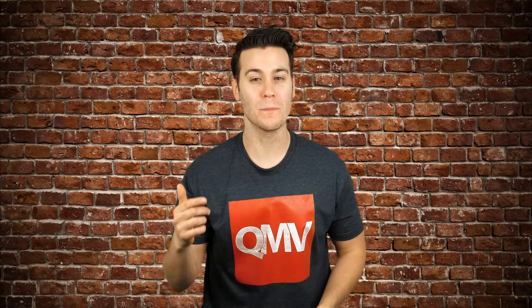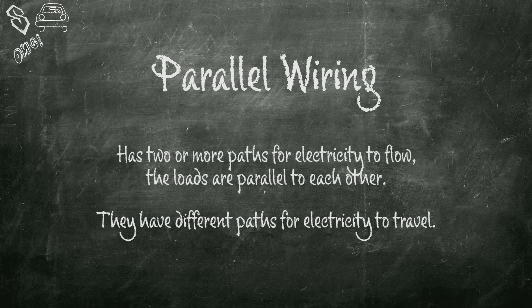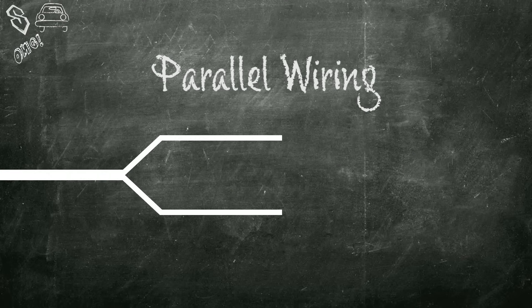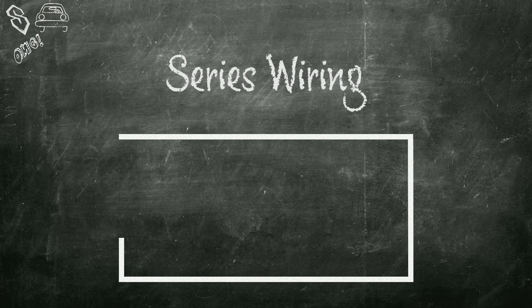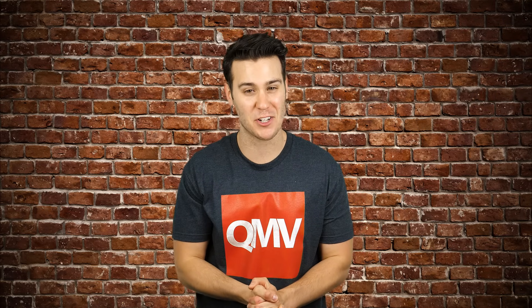Okay, so that's voice coils and ohms. Now let's get to wiring. There are two different ways to wire your subwoofers: parallel or series. A parallel circuit is one that has two or more paths for electricity to flow — like a river divided into smaller streams that all come back together. A series circuit has all loads in a row, meaning there is only one path for electricity to flow. For example, if the circuit was a string of light bulbs and one blew out, the remaining bulbs would turn off — the flow of electricity is disrupted. The total resistance of a series circuit is equal to the sum of individual resistances.